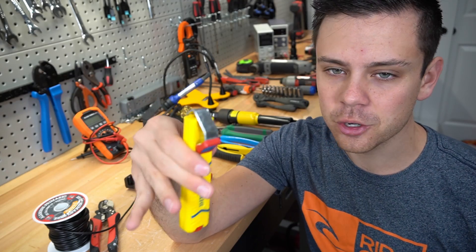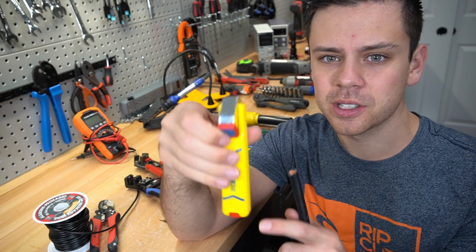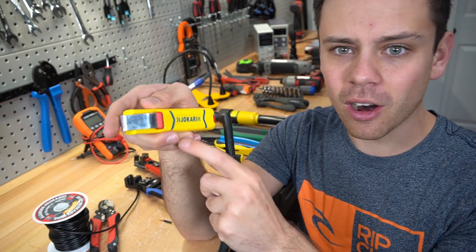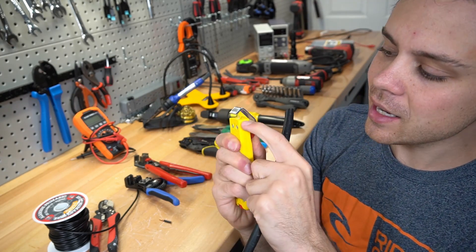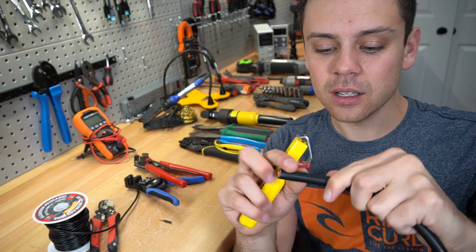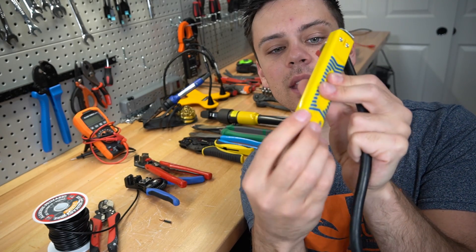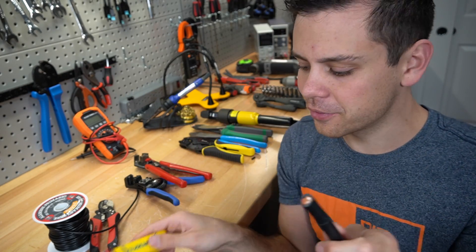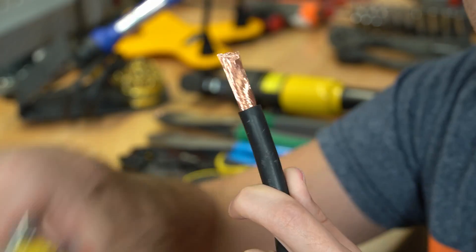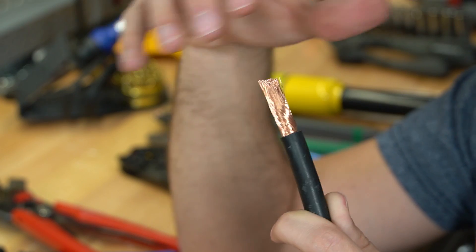Next tool is a cable stripper. If you work on large gauge wires for low voltage, you absolutely need a high quality cable stripper. There are lots of knockoff options on the market that are absolutely horrible. But this one by Jokari is perfect. You have a tiny blade in a little holder — you stick the cable inside and spin it around. Depending on how thick the insulation is, you adjust the blade by spinning this knob. And check it out — none of the conductors have been touched by the blade and all of the strands are present. This is why you buy high quality tools.